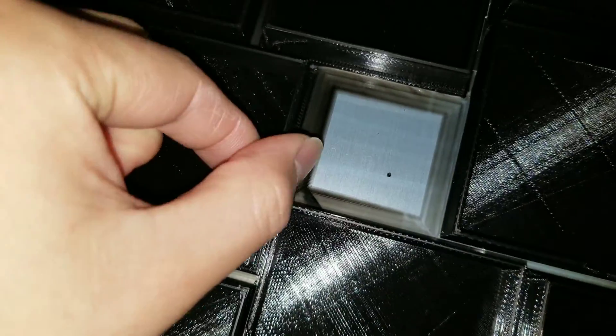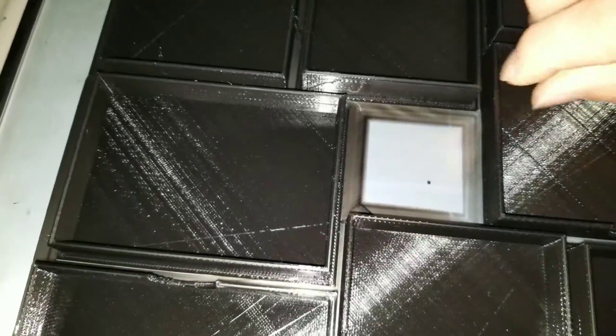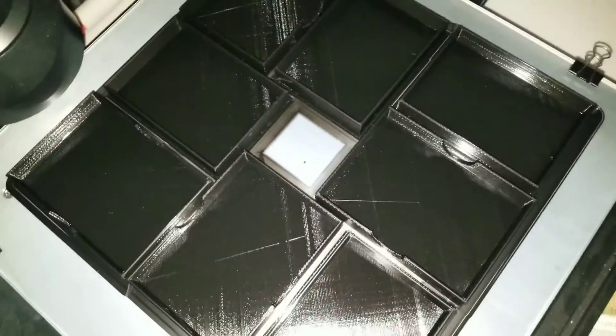You can hear it crackling away. You can try to help it by gently pulling — you can hear it's already coming out. It's getting much easier to peel up — that one already came out. You have to let the bed cool down first, which also helps. As the glass and plastic cool and shrink, little gaps form that the water can travel under. Don't put cold water on a hot bed or you could potentially damage the glass.